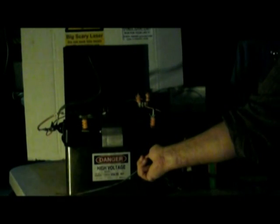Now shorting it on the case — hopefully we can see the size of the arcs at roughly 5,000 volts, or to be exact, 4,650 volts, because the total voltage is 9,300. The current will be 619 milliamps on the high voltage side, and it will be drawing about 12 amps on the primary.